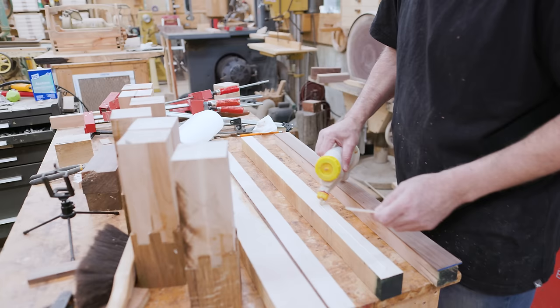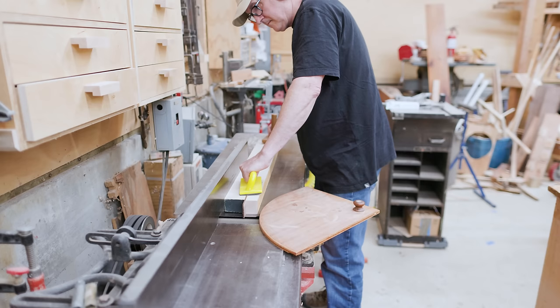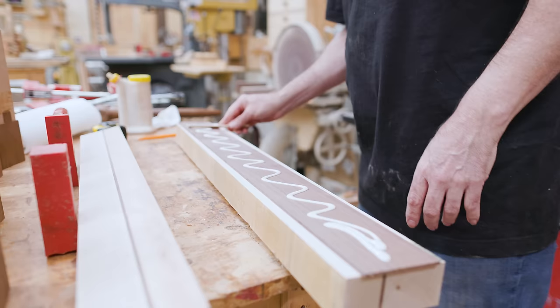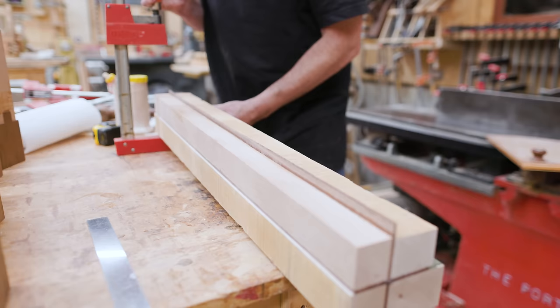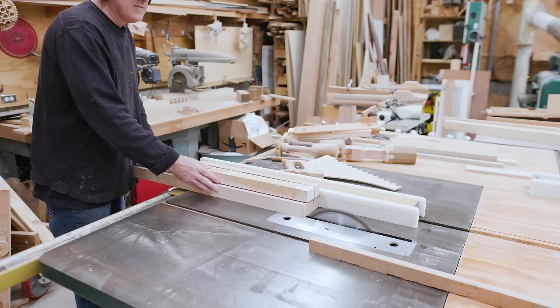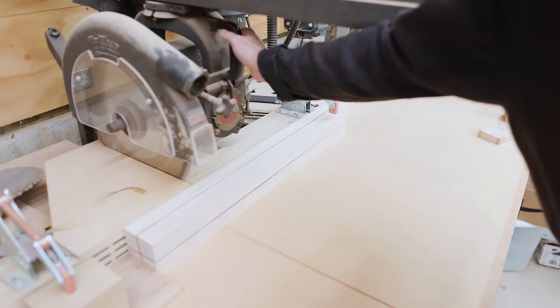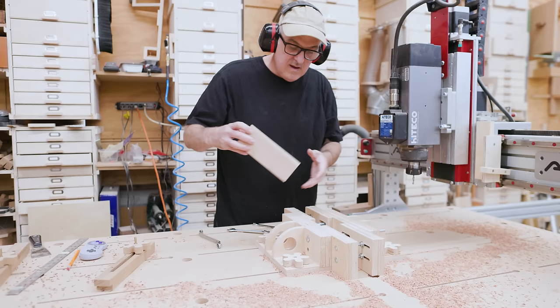With some leftover pieces I thought it would be neat to make a piece where the walnut is four-sided in the middle, forming a cross or X in the center. I glued up two smaller halves, then glued those two halves together trying to get the walnut to meet in the center, then cut that down to a square section with the X in the middle and cut it into handle pieces.